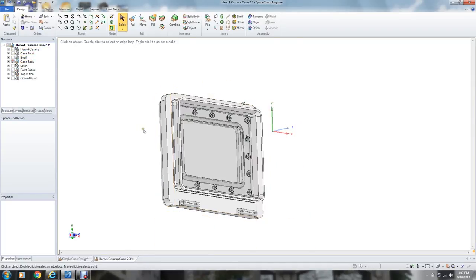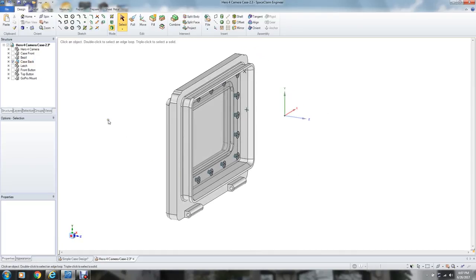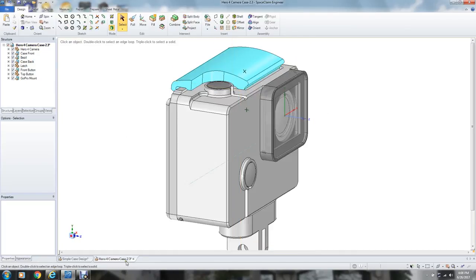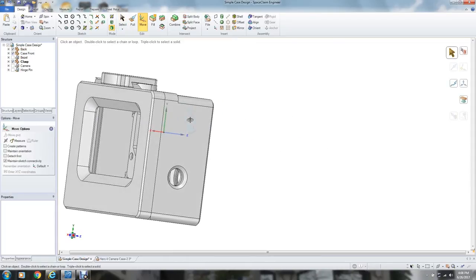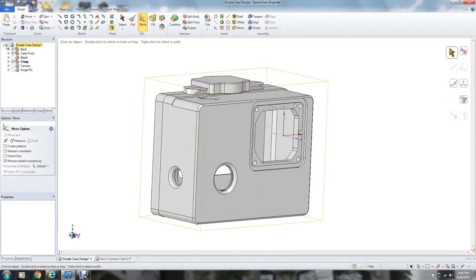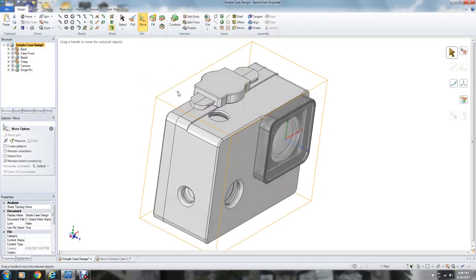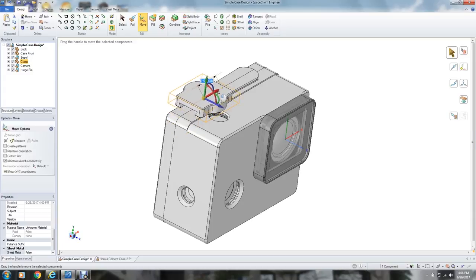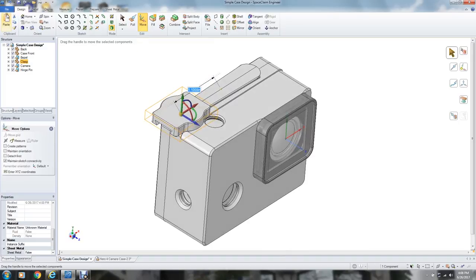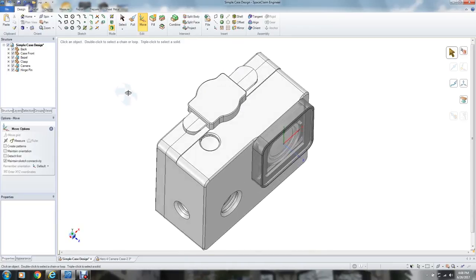So it's kind of a complicated machining job, and I was wanting to simplify this to some degree. So I designed this one, which is what I'm going to show in this video along with the machining of it. It's a more simple type of thing and it has this little clasp that comes on and off. It's got a tapered dovetail, so the further you jam it on, the tighter it gets.